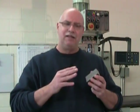So, on that first hot-rolled piece of steel, we had to attack 6 separate surfaces because nothing was flat and nothing was square. But on this second example, we have a cold rolled piece of steel that has good flat and parallel primary surfaces and good flat and parallel secondary surfaces. Really, the only surfaces that we really have to work on here are the tertiary surfaces because they were cut with a bandsaw. And if we wanted to, we could attack these tertiary surfaces as we did with the other block, just skipping all the first steps of that squaring up operation and just finishing with the tertiaries.